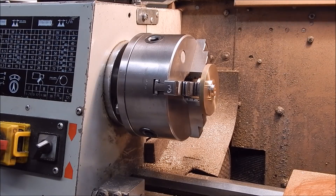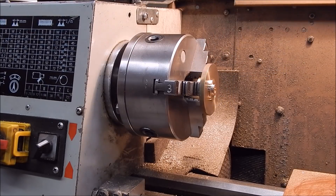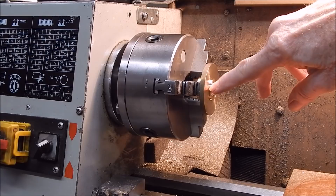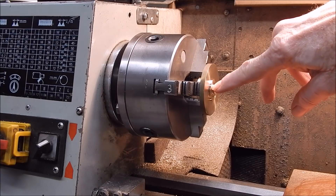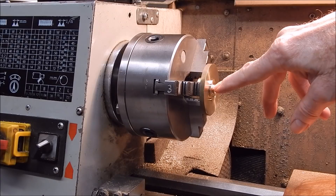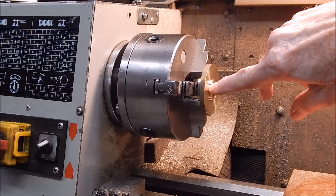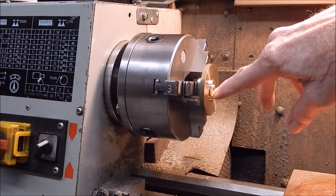The flywheel is 6mm thick and I've got to cross drill it through to the center and tap it for a 3mm metric grub screw. Basically I have to drill in with a drill size suitable for tapping a thread, and then I've got to drill through partway — probably to about the shoulder here — to open the thread out so that we're not tapping the whole distance, and then it's just a matter of tapping that last section.